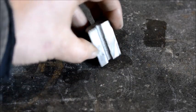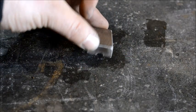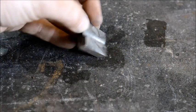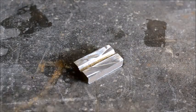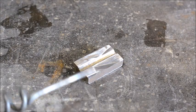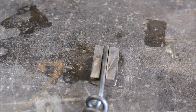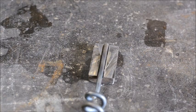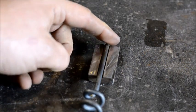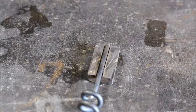Okay guys, as you can see here I got these cut in half. This one here wasn't quite drilled in the middle, but I made this groove here that this piece can sit in — as you can see, nice and comfy, just like so. Next thing I'll do is lay a bead of weld along the top here, along the other side as well, and then grind that off nice and smooth on top.